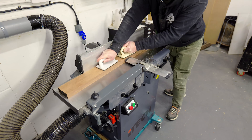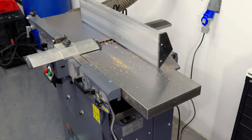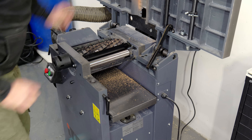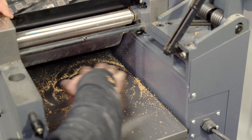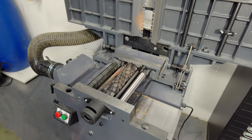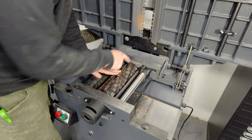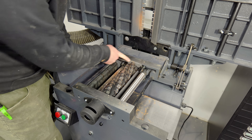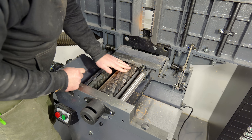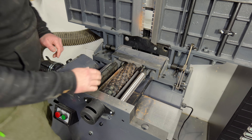I can repeat the test now and my face might be a bit of a giveaway. Still a few chips on top but that's to be expected with a planer I think, but look at the difference — as if solving the problem was that easy. There is still some fine dust and chips here but nothing like the quantity before. Clearly what was happening was the cutter block spinning caused chips to come down through the channels between the rows of blades and fall through this gap, because the vast majority of chips were always on this back side. Some chips would also have been coming over the top of the shroud and underneath the planer bed, but wow — what a difference.